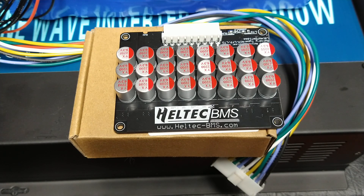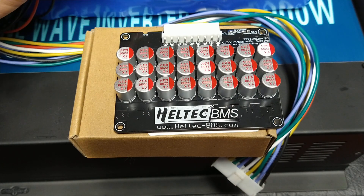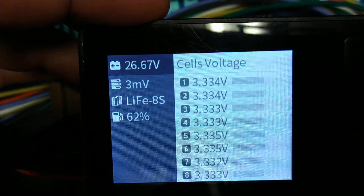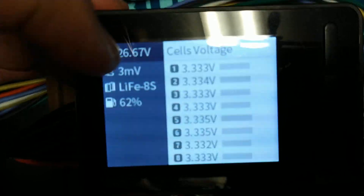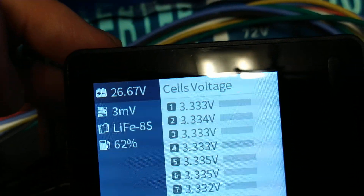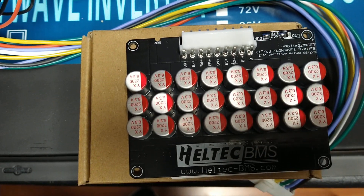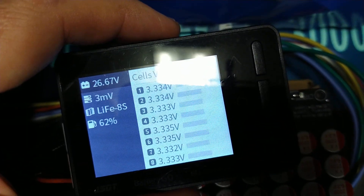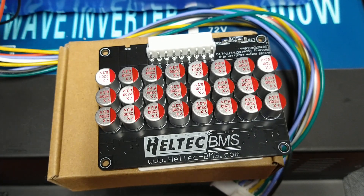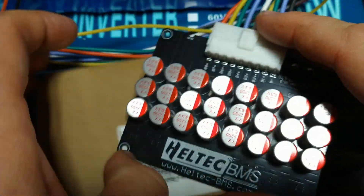It does the same thing whenever you're discharging, and depending on the load you'll see it does more or less work. If you're pulling a small load you can see it's pretty nicely balanced right now. A small load would show the millivolts go higher as far as cells being out of balance, and with this active balancer plugged in it would be less out of balance — and that effect is more dramatic as the load goes up. I'm going to plug it in, pull a load, and show you what it does in real time.